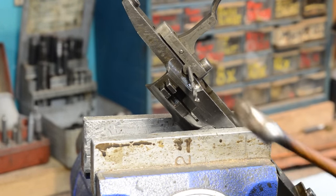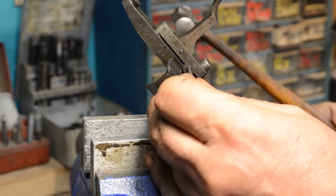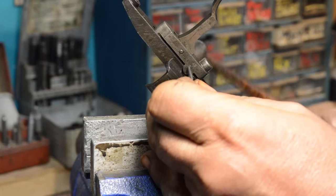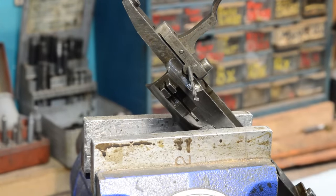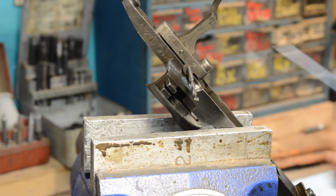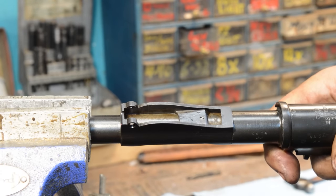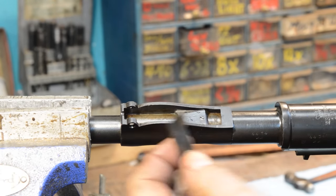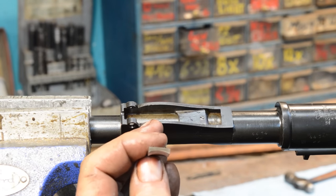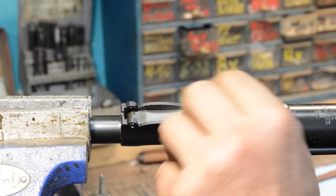Notice it's just an old broken drill bit. This is captured. Then all I'll do is come in with a Dremel tool and nick that off here. Bruno's got this up here — I'm going to roll this just a little bit so we can see better. The bottom of this spring has a distinct curve in it, which tells us that that rides down in there.